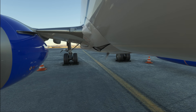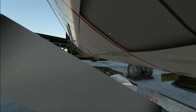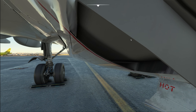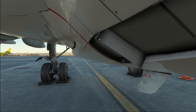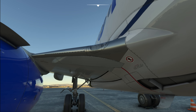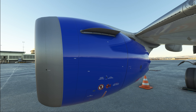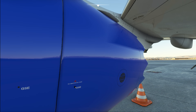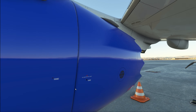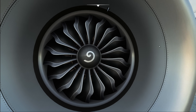Moving further to the back, we have the inlet area of our packs, and we want to make sure that there are no birds nesting behind the ram air door — this is a warm place during winter and spring, so birds are prone to build nests there. Next, we check the condition of our landing lights and the leading edge flap, then start having a look at our CFM LEAP-1B engine. We check the general condition of the engine and verify that the thrust reverser deactivation pins are not installed. We also look inside the engine to make sure the acoustic lining is undamaged and all fan blades are undamaged.